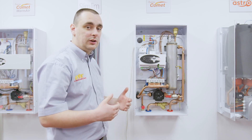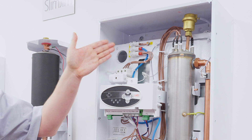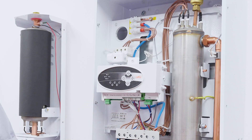Once the vessel is charged, the last point to check during a service would be the electrical connections — primarily the main connection at the top of the boiler where the original installation supply cable was connected. After that we can quickly work our way down visually through all the manufacturer's connections to ensure that they are also secure.